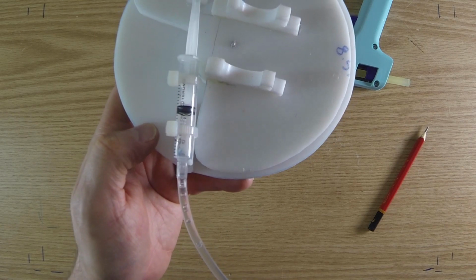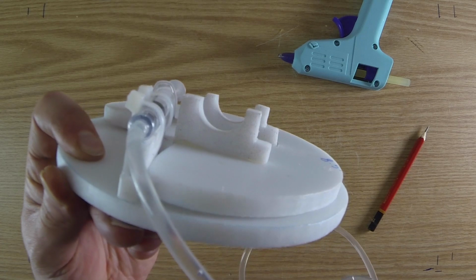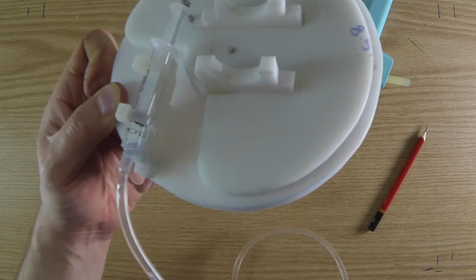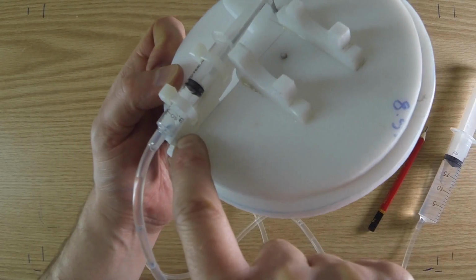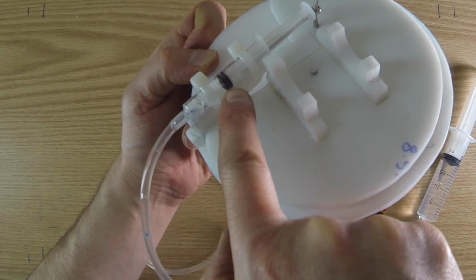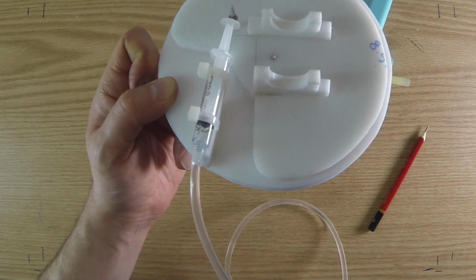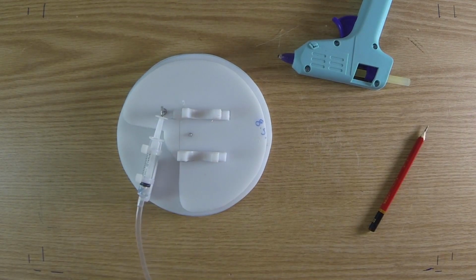Well, I said earlier you could cause the small syringe to fail quite spectacularly if you tried to force the volume of water of the larger syringe into it. The turntable swivels to the right until the edge of the cutout jams into the moving hinge with its steel nail reinforcement, forming a hard mechanical stop and thus preventing you from moving the full volume of water and popping the small syringe like a cork.